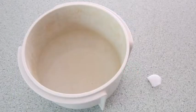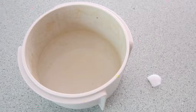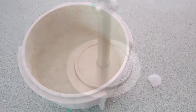Heat up a container with some water and the polymorphic thermoplastic strips in the microwave until the water boils. Or boil up a kettle and pour the hot water over the strips in the container. White will become clear when it's hot enough. Form a ball and push it into the taper part of the bottom die. Make sure it is all below the surface of the split washer.